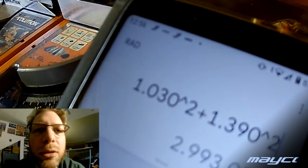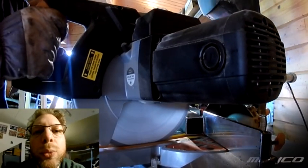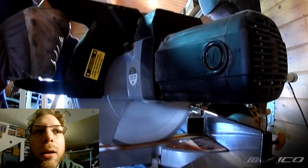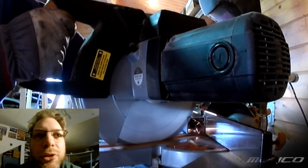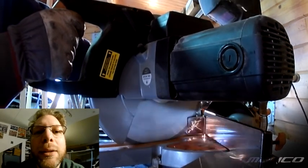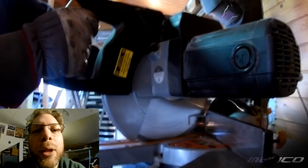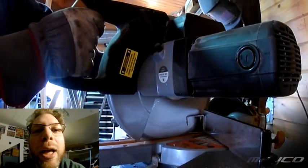The difference is that with a proper welding machine you can basically hold your torch in a certain position and pull it along the seam that you want to weld. However, with flux you have to move your torch left to right, or in a figure-eight, or in a C-type curvature, so that you can make a bigger weld. If you just weld like you would with a normal MIG torch on a professional device, you expect to get a certain weld width — but with flux you are never ever going to get that.